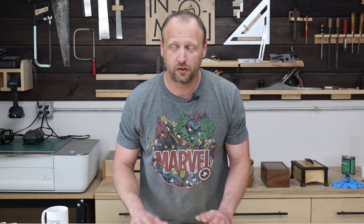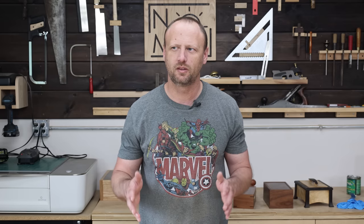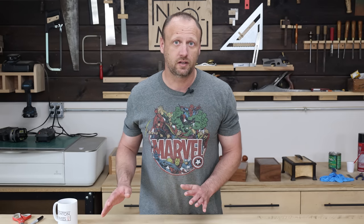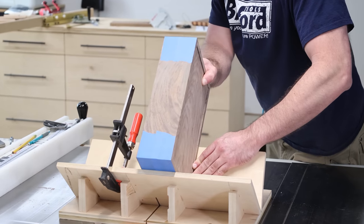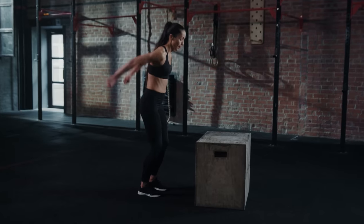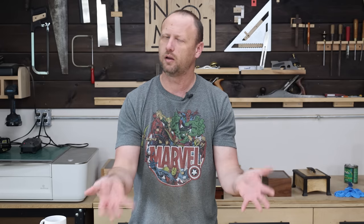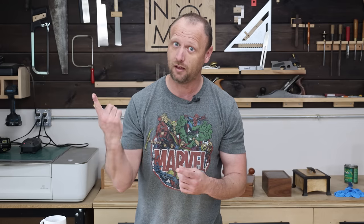Joinery is super important for figuring out the design of your box, but it may not be important for the same reasons that a lot of people will tell you about. We're going to get into a controversial topic here — some people will probably not agree with me. I will pick the joinery based on what I think looks best for the box. I don't pick the joinery because of its strength. That means I'll make a box and I don't necessarily have to have my miters reinforced with dowels and splines and a bunch of other things. I look at it as: it's a box — it's not supposed to hold a tank. It's a decorative box. Now, if your box is supposed to serve a particular function, like you're building a cabinet drawer — that's really a box — well, you have to put a lot of weight in it and you're going to be opening and closing it. It serves a function that is going to impact your joinery. Functionality, joinery — two of those tenets of building your box.